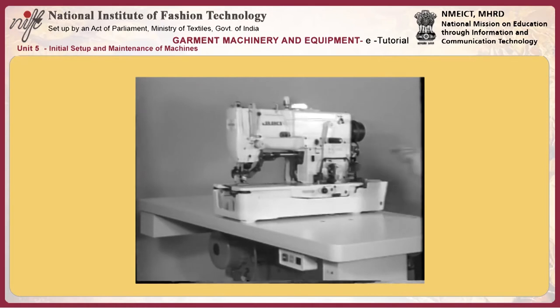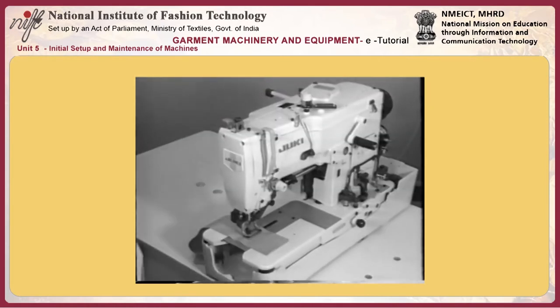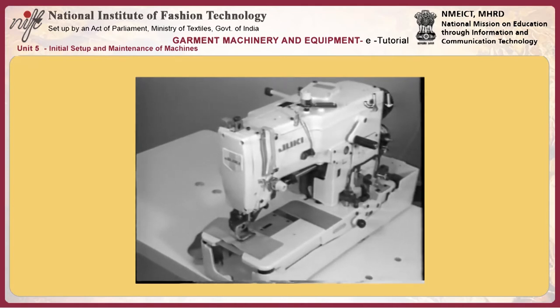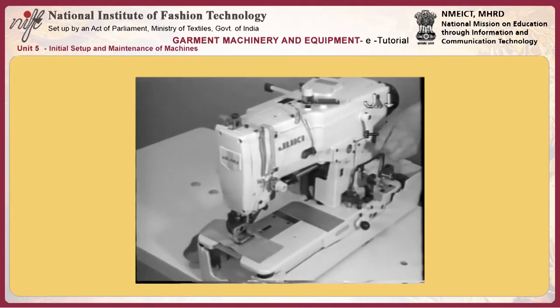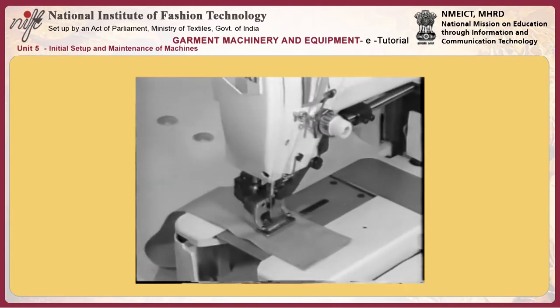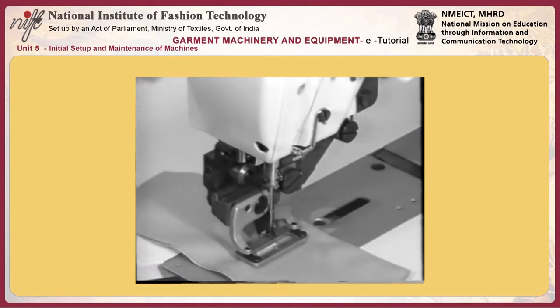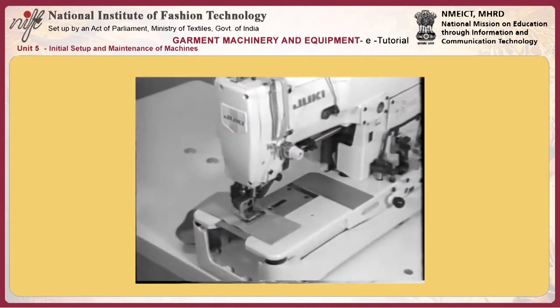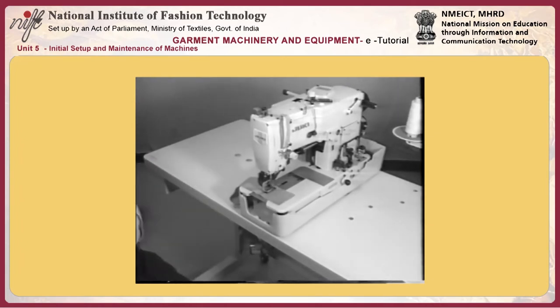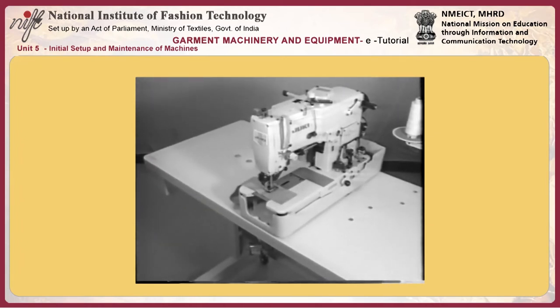Even when the machine is running under the high-speed mode, you can immediately cause the machine to run under the low-speed mode only by lowering the stop handle. Emergency stop of the machine. Turn the stop handle in direction I, then the machine will stop immediately. Depress the foot pedal, and the sewing machine will start again.